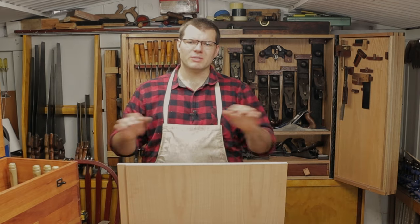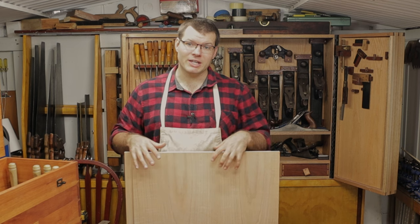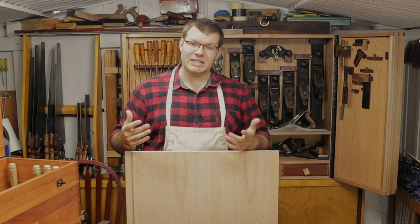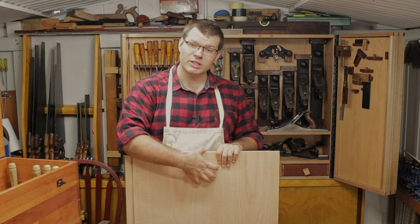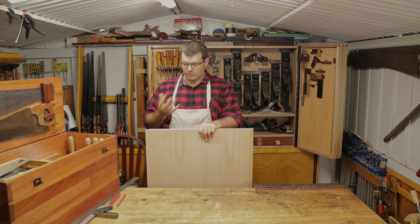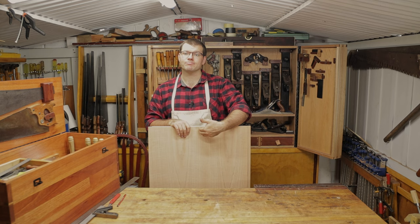And in choosing the plywood, it's important that you try to get as good a grade plywood as you can for this box, because you don't want it warping and moving. Obviously the screws are going to be holding the main part of it together, but we're going to have an unframed lid that's just the straight plywood on the top. So a good quality plywood that's not going to delaminate on you is kind of essential. What I have here is red oak veneered plywood, and that was just the best quality I could get. And this toolbox is going to be painted, so if you don't like the way your plywood looks, the quality of it doesn't matter so much for the visual aspects of it.